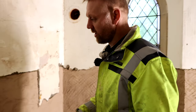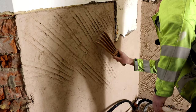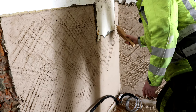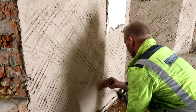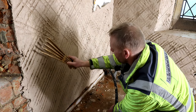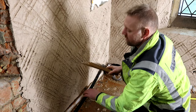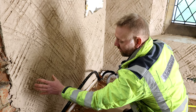It's pretty easy to scratch up — we tend to do it on diagonals, both ways. You see it tears up that surface, and also the hair in there gets pulled out from that base coat, so you get them bonding from the hair between the coats. Anytime I see plastering done that's been scratched up with a standard plastering comb — just drives me crazy. You just don't get that good bond between the layers by using a standard plaster scratching coat. You can see now we've got the hair strands coming out and we've got a good key for the next coat to go on.